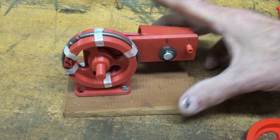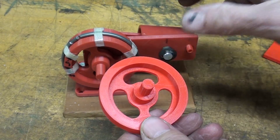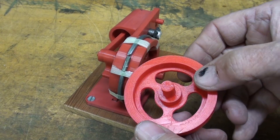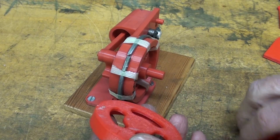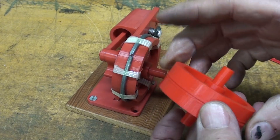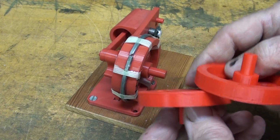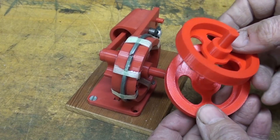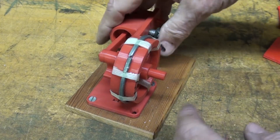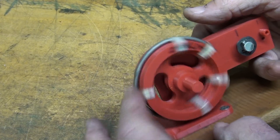Here are the improvements I made. It was designed to run on one flywheel alone, but one flywheel doesn't have enough mass to it, and it is finicky. What I did was print out two flywheels and glue them back-to-back with epoxy, which gave more weight. You also get more weight by printing them 100% solid rather than with a 50% fill, though it takes a lot longer to print. That still didn't give me quite the weight I wanted, so I wrapped a piece of solder around it — crude looking, yes, very crude.